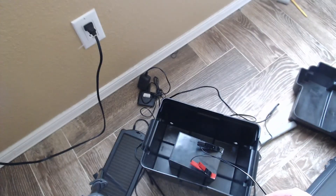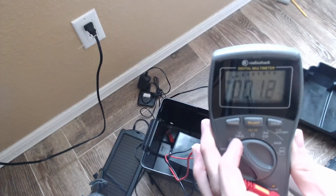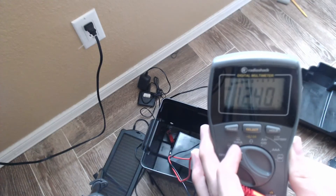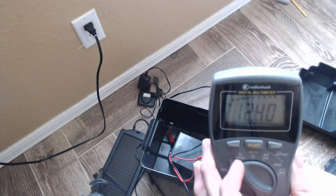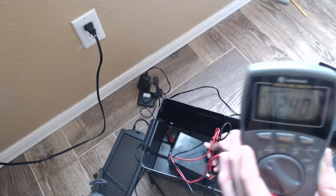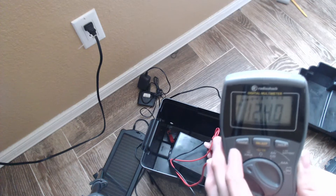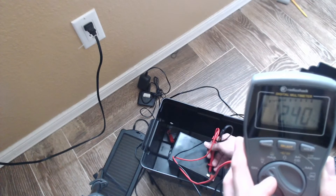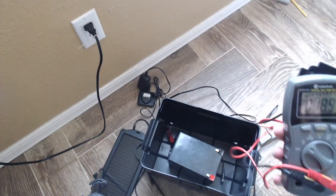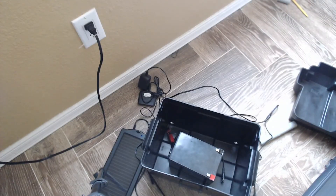What we're going to do is take this out and measure the battery voltage to see if it has charged over the past week. It's actually 12.4 volts, which means we have lost charge — the solar panel has been leaking power. This is what happens when you don't have a charge controller or at least a diode connected to your solar panel. What we're going to do is connect it to the hub and see if the hub would also be useful.